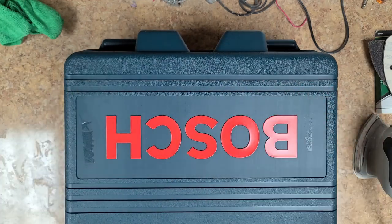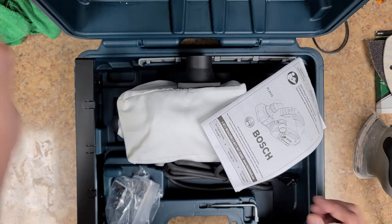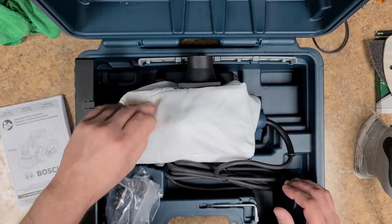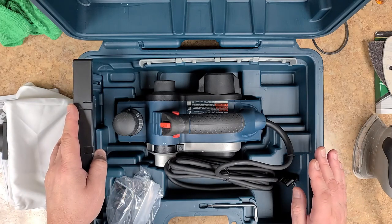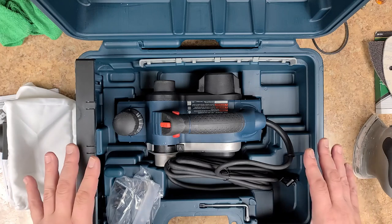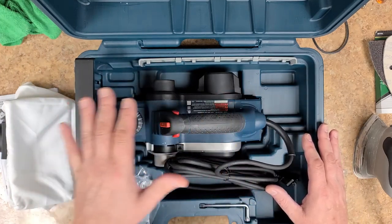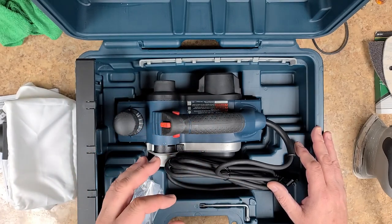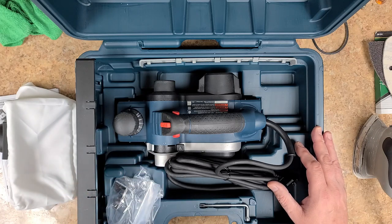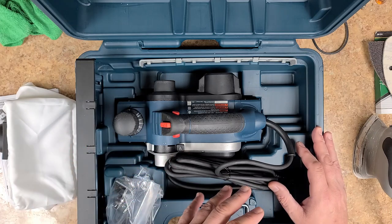That's it. And then I will use the veneer, or use the wash, because I do have to do something here, which is not going to be fun because that mahogany is hard wood. I'm going to have to clamp down the body and use the planer and go over the top of it. I need to knock down about a 16th of an inch off the top of this body to make this work for the new veneer and the finish on it.